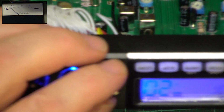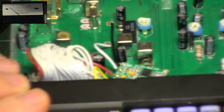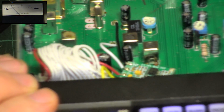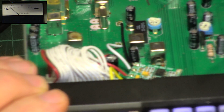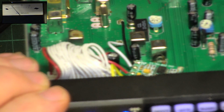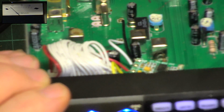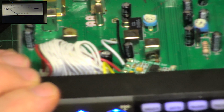So we'll switch it to that position. So now we switch to that. That's what that subboard does inside. So we'll switch the signal generator on. Again, we're at 0.3 of a microvolt. And that's cut out, which is fair enough. So let's see what it's set to. So it's set to come in at 0.11 of a microvolt. And it leaves it 0.09 of a microvolt. So once again, that's very good.